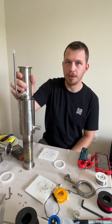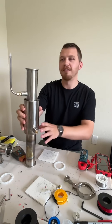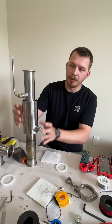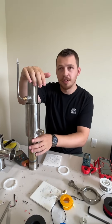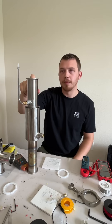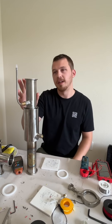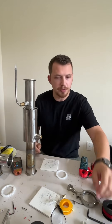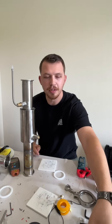If you've been following my YouTube shorts, this is the homemade thermoacoustic Stirling engine. I've finally come into a design that I'm happy with. It is all one solid piece, 304 stainless steel. There are no moving parts except for the diaphragm on the top. It uses heat to create sound through a stack, and then that sound moves the diaphragm up and down.